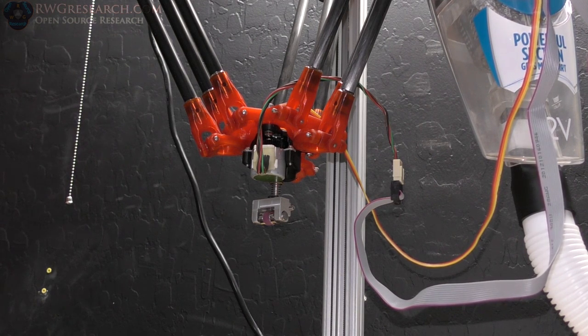The other thing is really to do it point to point like we're doing it, as long as everything is arcs and circles and very tight points, then it should probably be fine. So if we were wanting to do straights and stuff, we would need to put the command to turn the head rotational on its own line, which means it pauses at every single position, which is really not a great thing. Now sometimes you want to pause and turn, and other times you don't want to pause and turn. So we've got a lot of work to do on the script and trying to figure out the best solution for that.